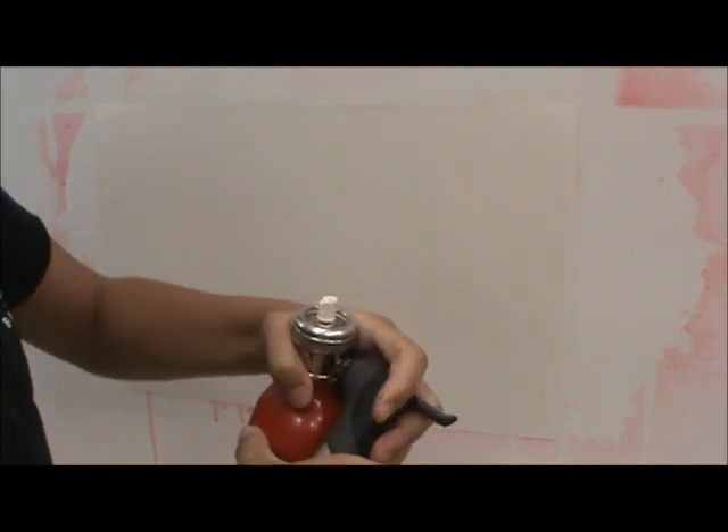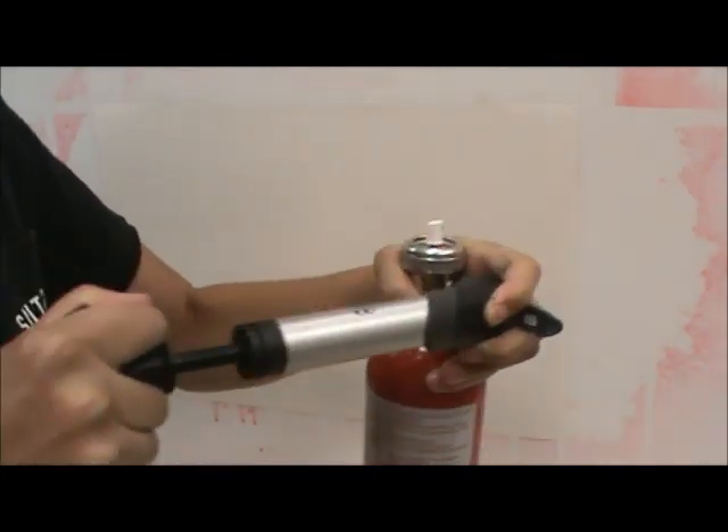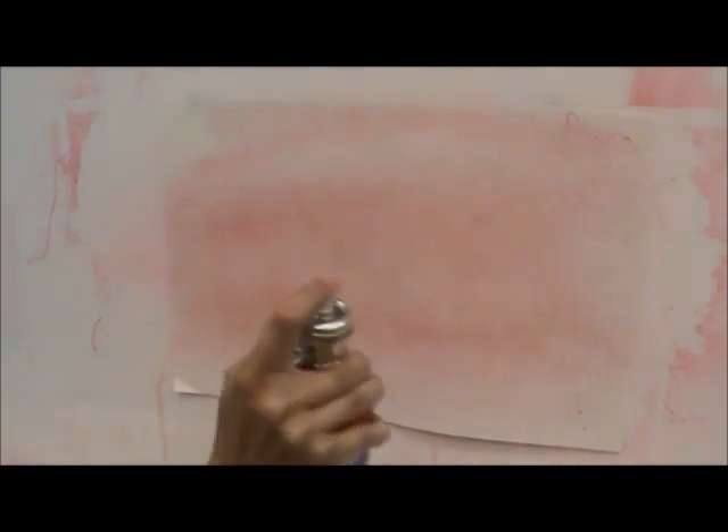This is using a coarse sprayer at about 60 PSI. We find that the higher PSI creates a better spray pattern. For example, 60 PSI has a very smooth pattern, and above 60 PSI simply causes more polymer to be dispensed faster.